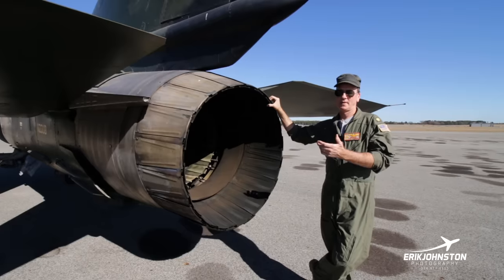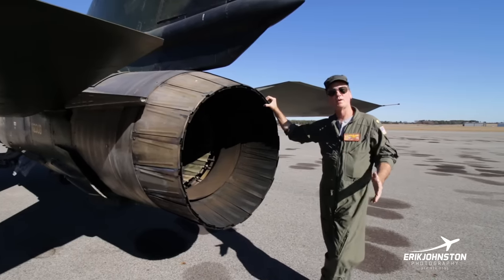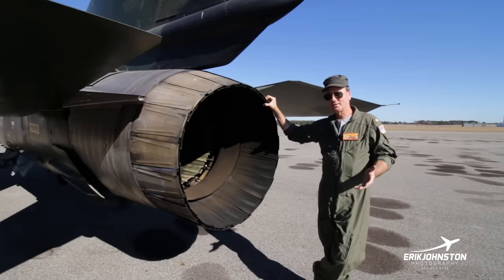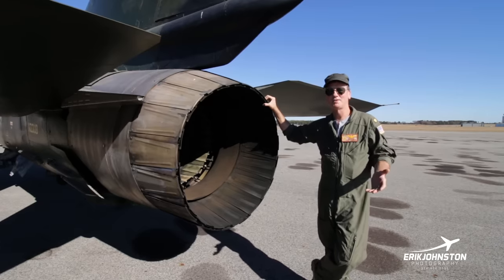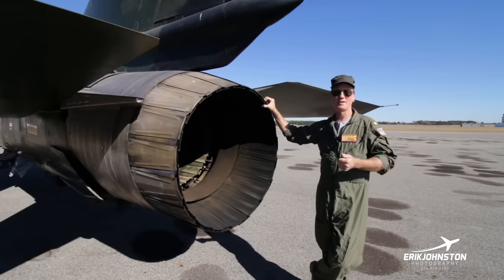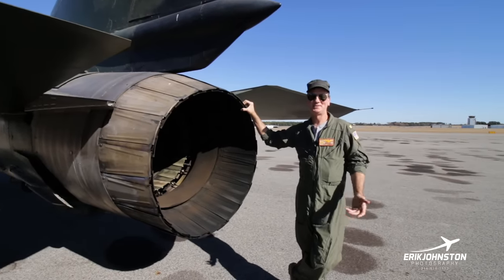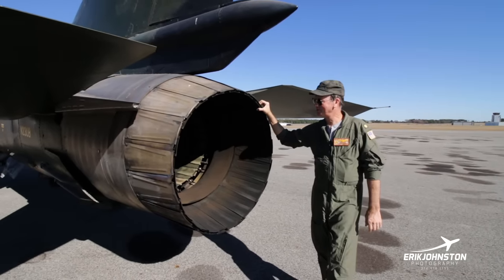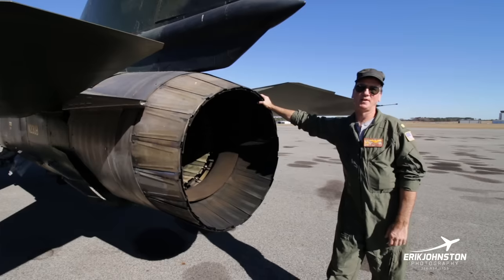like you really want. The Soviets and some of the other countries would have a trough full of water that they would taxi through and cool the brakes down using water. Seems like an engineer's nightmare that you're putting cold water on hot brakes, but this is what they did and it seems to work. And I've done it here too. I come back and I just get out the garden hoses and start cooling them down. They don't crack. They look weird, but last a long time, steam coming off. Or you can put brake cooling fans. I have some portable fans that I put on there too.